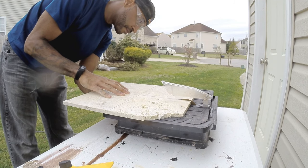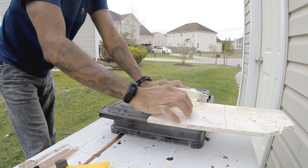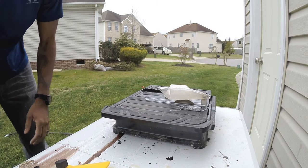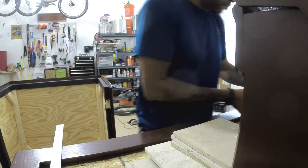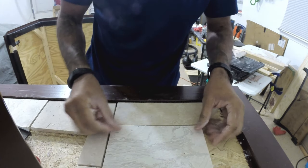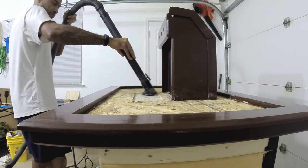Pro tip: if you are buying tile for your top, don't buy travertine. This stuff is really difficult to work with — it is so brittle. Even with a wet saw you can see pieces just snap. Luckily I had enough extra from doing my kitchen floors before, so even with all the pieces that broke off while I was cutting them I still had enough to do the bar top. But if you're buying a product specifically for this project, I would not recommend travertine. After doing it though, I'm really happy with the way it turned out because it tied it into my kitchen and has that nice natural stone look — but even on a small bar top like this, the minimal cuts I had to make were really difficult to keep the pieces from cracking.